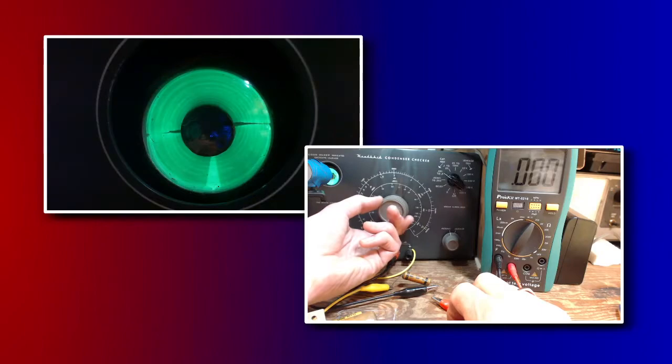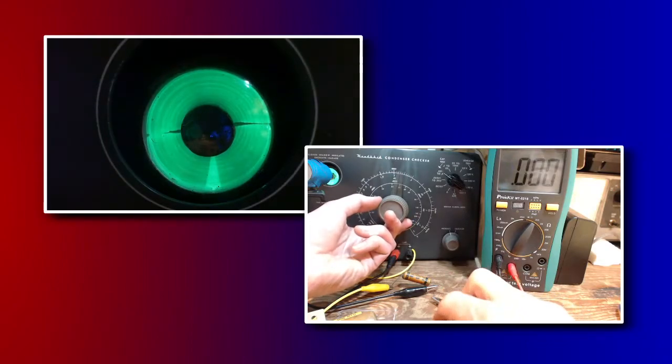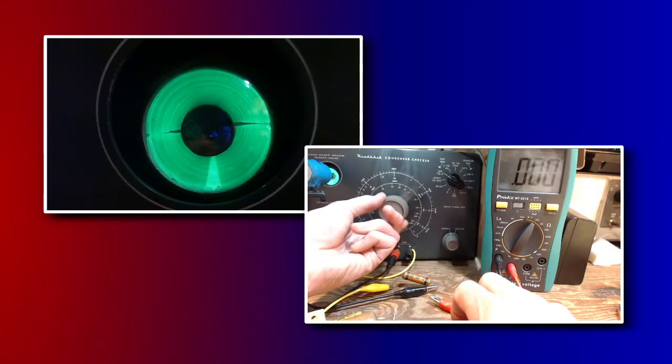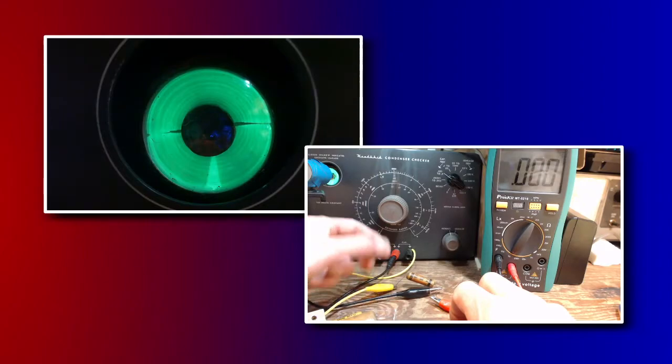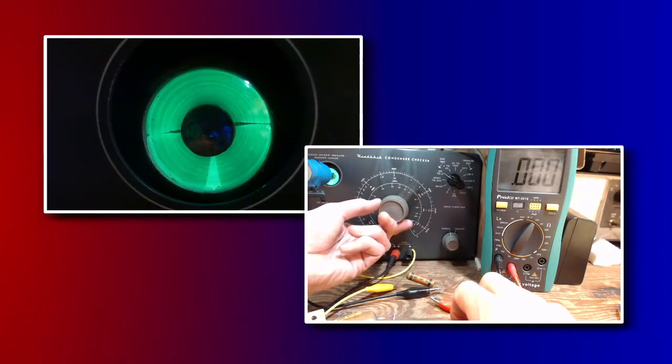I wouldn't want this capacitor to be leaky, considering how it was used in the radio, because a small leak will charge up the grid positive, or more positive, on the output tube, and increase the current flow through the output tube. Eventually, you cut it right off. If it gets high enough, it can damage the output tube from it overheating from too much current going through it.